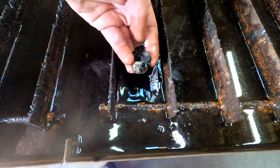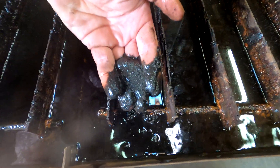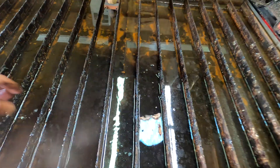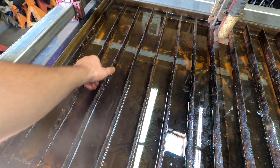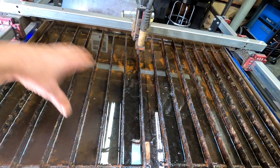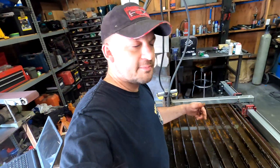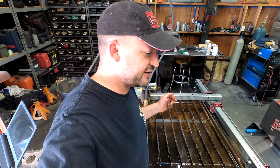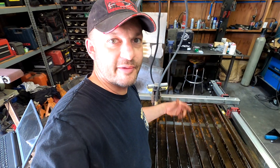We're going to drain all the water out of here. There's a huge amount of slag and cut ends — all this stuff built up in here. It's a combination of aluminum, stainless, and mild steel. And even though the trays are stainless, eventually if I just leave it in here, there's going to be some galvanic corrosion that occurs and it'll end up eating through the trays. Normally I don't let it sit for more than a week or two, but I've got no projects planned, so it may be sitting two, three, four weeks. I located a recipe for an anti-corrosion mixture — I'll post a photo of that up here — and we're going to mix some of that up and try it out. I'll post a follow-up video in a couple of weeks and we'll see how well it limits corrosion inside the water table.